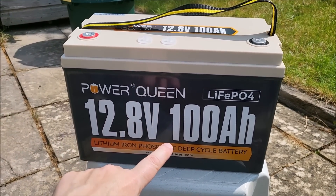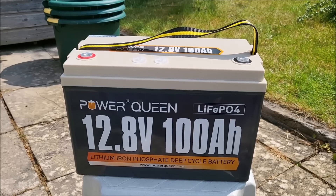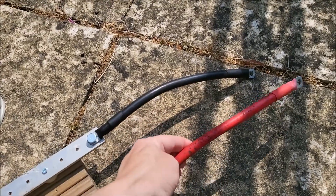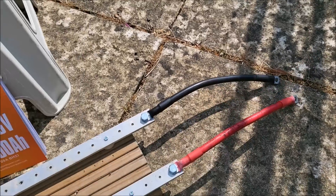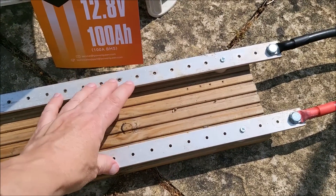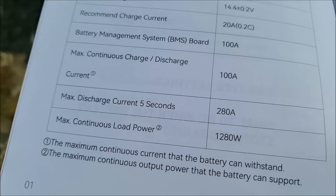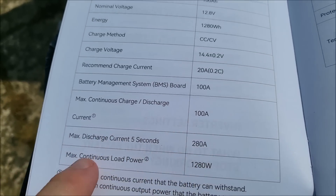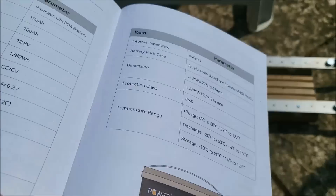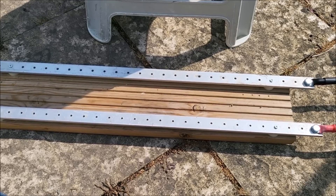This battery is rated for continuous discharge at 100A and you can also charge it at up to 100A. I was thinking how best to test this battery, so I came up with this contraption — a couple of very heavy current straps with M8 ring terminals, and two bus bars which I can plug banana plugs into and put lots of loads in. But the manual says the maximum discharge current for 5 seconds is actually 280A — so do I discharge at 100A or load up to 280A and exceed that 5-second spec? It's all a bit over the top really, so I thought I'd do my tests at a lower current.